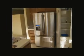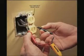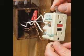Anything in your kitchen needs to be grounded. If you want to change this out, you have to get a licensed electrician. He'll take the old one out and put in a GFCI receptacle for a three-prong, or get your house regrounded. With a two-prong, your house is not grounded and your receptacles are not grounded. That's when you have to do your rewiring on your receptacles to go with a three-prong.